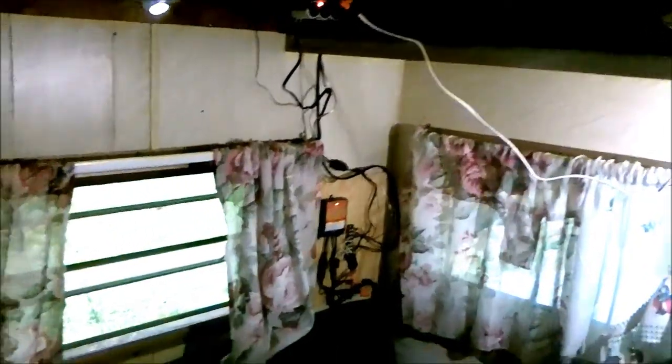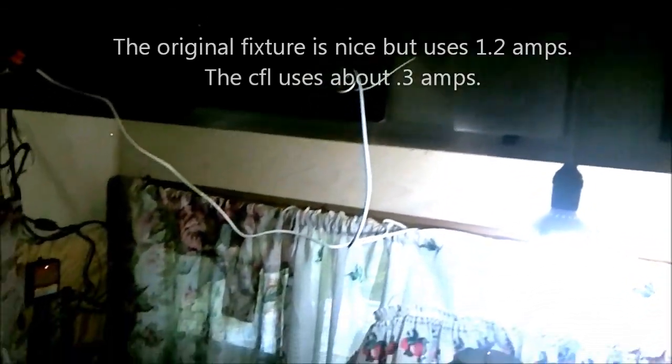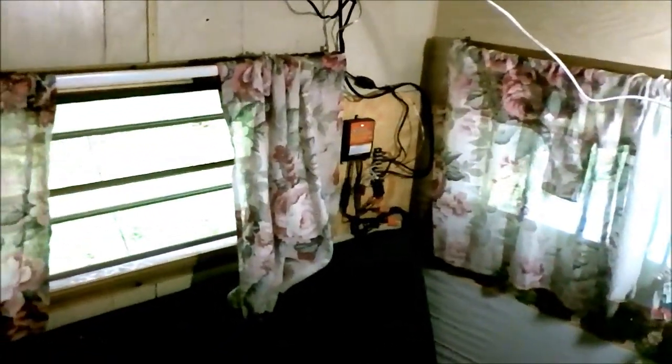There's a ventilation fan which doubles as an oscillating fan hooked into the system, with a little switch for it. Over here I have the 12-volt style outdoor plug — there's one just like it on the outside, so I can hook things directly into that. There's also a bracket for additional lighting in the back. I salvaged one old light system that uses a small 12-volt bulb, but the LEDs or CFLs use a lot less power — the idea being not to overtax your solar system.